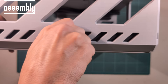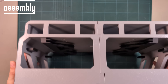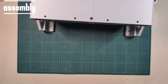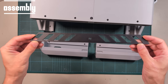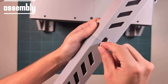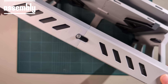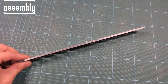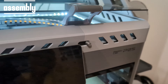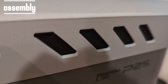The little knobs with threads are for the air vent slider — same on the other side, but there I have to use pliers. For the drawers, there are two end stops that are a bit finicky to get in the right place. On the front go two pieces with the third ventilation slider, connected with two pins and a thread-in knob. Then four more pins connect the front to the rest of the riser. A tip I wish I had known: you could print the sliders a little thicker so that less warm air escapes — just stretch the part in the Z-axis in your slicer to find the sweet spot.